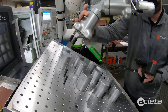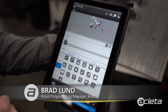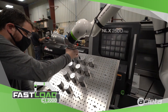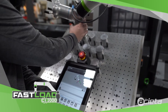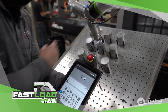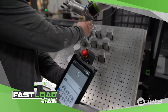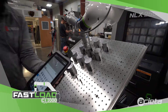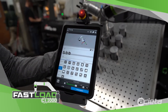We're going to start with teaching our perch position. Because the robot is already in position, we're going to drag and drop our perch icon. Then we can drag the robot to the approach position. Then we drag the icon for that movement in, and drag it down to the actual pick position. Drag the next motion icon in place — it automatically records that point.